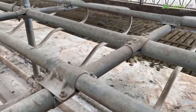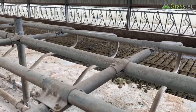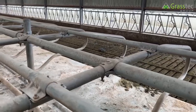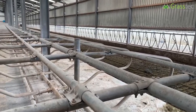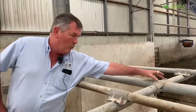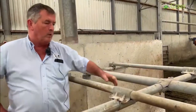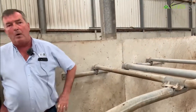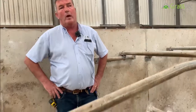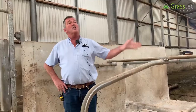Double mounting brackets are used with four bolts, not two. Most others hang the cubicles on two-and-a-half inch pipe with only one bolt. Here, four bolts are used — two squeezing under on the pipe and two squeezing on the cubicle, top and bottom. All cubicle piping is mounted to the side of the rail, not welded — it's u-bolted to the rail.